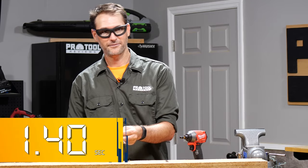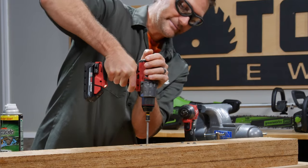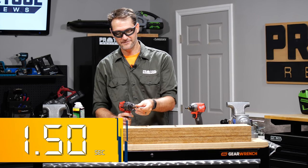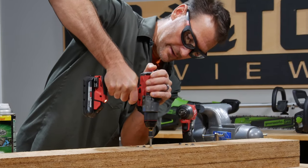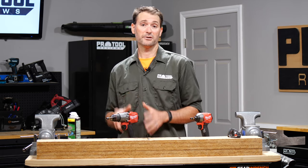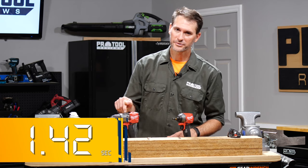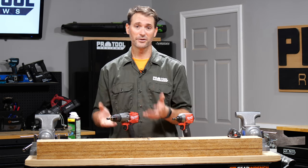140 — like one second, 0.4? That's really fast. Ready? Three, two, one, go — 150. Last one. Three, two, one, go — 135. Clint's going to do some math. Obviously the drill was faster, and if you look back at our drill versus impact driver video, you can see that's actually pretty consistent. So the final numbers: 2.6 seconds for our impact driver, 1.42 for our hammer drill. But here's the thing — we would never actually use hammer drill mode to fasten in wood. If we did want to use it, we'd just throw it into drill driver mode. So now let's take it outside to the concrete and see what happens.